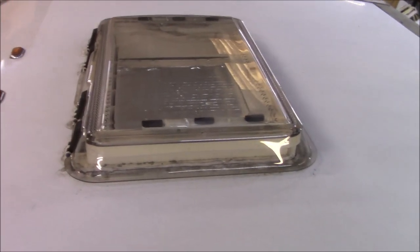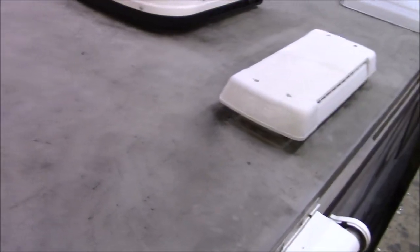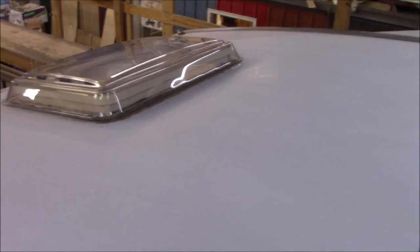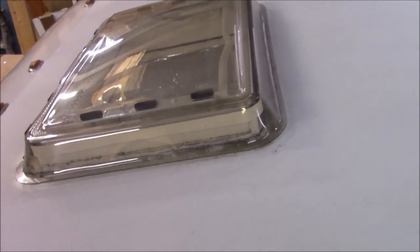I'm not sure how I'm going to address this but I want to get that up on a curb. This portion may not need to be redecked at all — it seems pretty good. This is Phylon right here so I really didn't want to tear all that up. If the deck is good then I can glue to it, bring the roofing all the way up, weld my curb, and bring it down and around. More than likely we're going to bring the roofing up and terminate it right at that line, then put the curb up on there elevated like it should be.